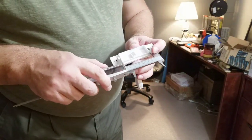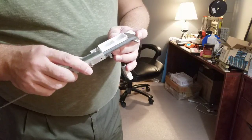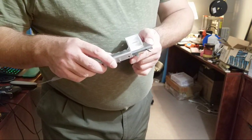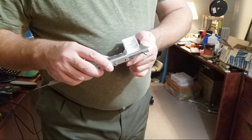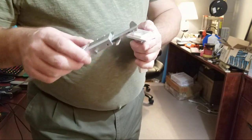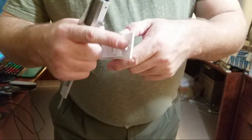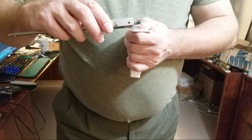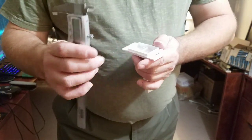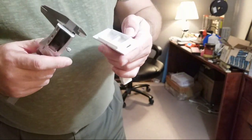The other important measurement was this area that protrudes through the Decora cover plate - I got a measurement of 66 there. I recorded that in my dimensions inside Fusion 360. I got a width of 32.8, which is almost like 33, but I rounded it to 32.9. So that's what protrudes through. But then there's this little fillet here - this rounded corner. I tried my hardest to get a measurement on that by eyeing up where I thought the radius started, and I got a measurement of 2 - so that's 2 millimeters. And when I designed the part and put all that in, it worked out perfectly. It fits the Decora cover plate.